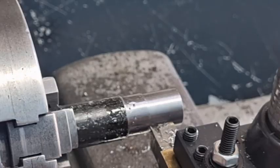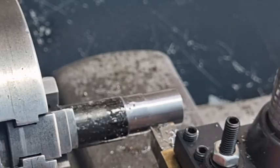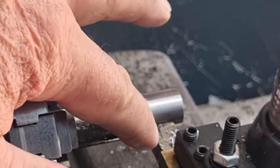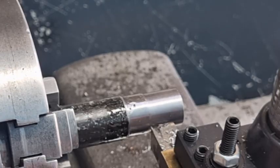For the beginners, just remember you need a little bit of a groove at the front because it's the side that does the cutting. The metal jumps over and goes down to that dip and it causes it to curl and snap off, and you usually get a slightly better finish too. Anyway, thanks for watching, bye for now.